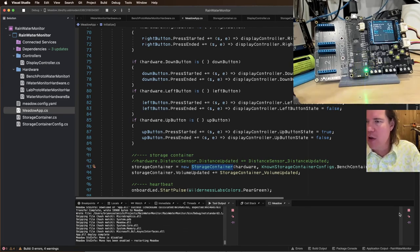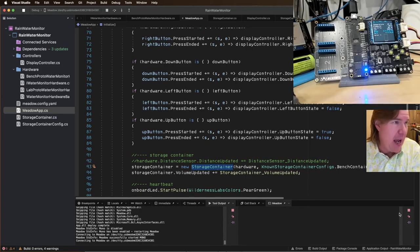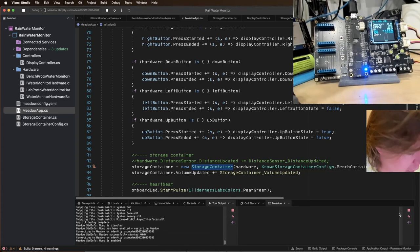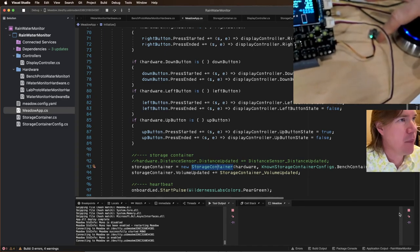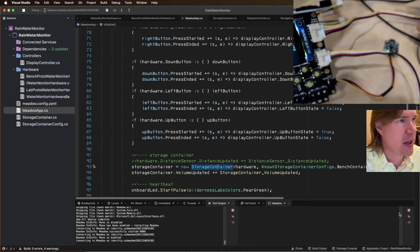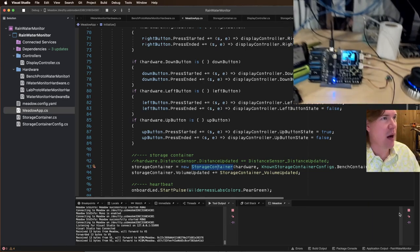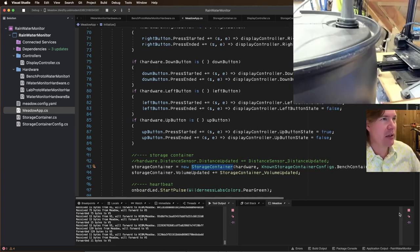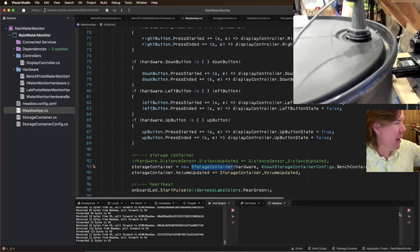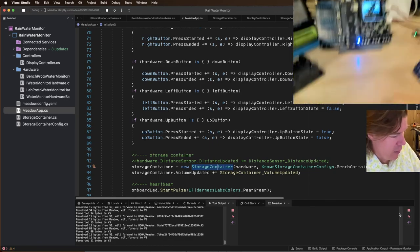How do you measure the volume or levels in the cistern well? So we have rangefinders. There's a couple of them on our lab bench prototype. We have this one right here. It's just this time of flight sensor, and it sends out a little IR pulse and then measures the time to come back. And then for our lab prototype, we have this. Here's my giant rain barrel, and then I've got this MaxBotix sonar here. So that's how we measure.